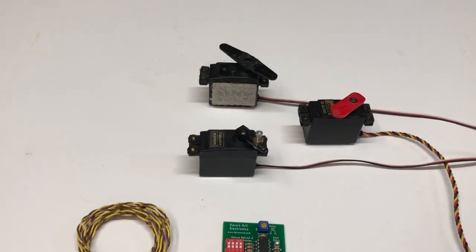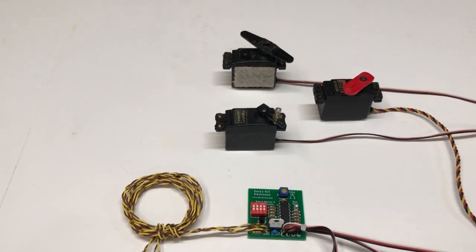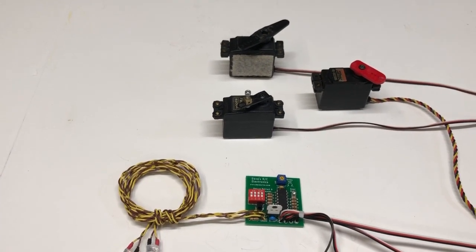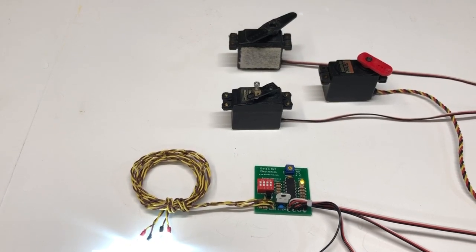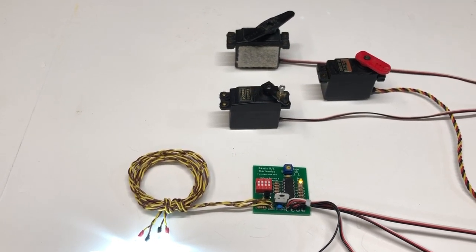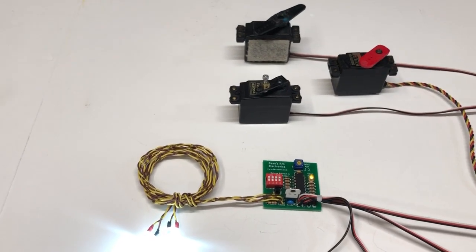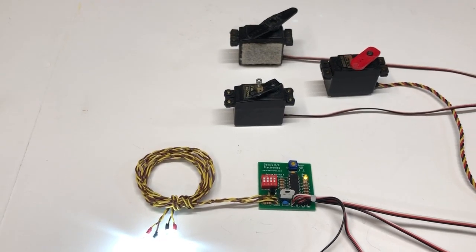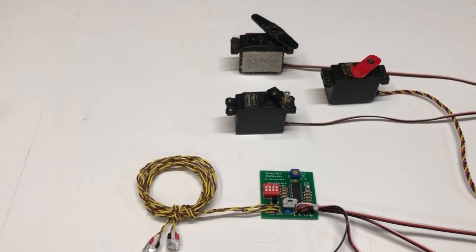So let's toggle it again and just let you watch. We're in the gear up position now. We're going to see both gear doors open. The retract goes to the gear down position. Landing lights come on, and then the aft gear door closes. When we go gear up, the aft door opens. The retract controller toggles. The lights will go off after a suitable delay, and then both gear doors close.